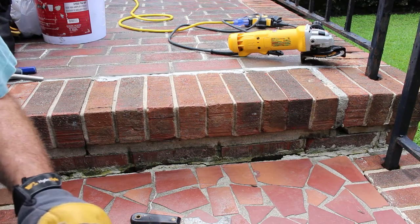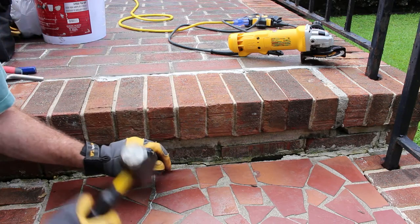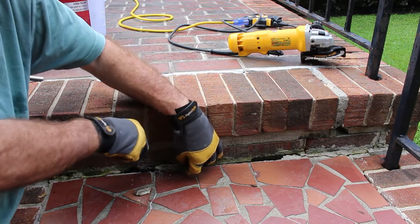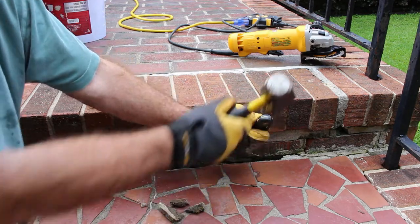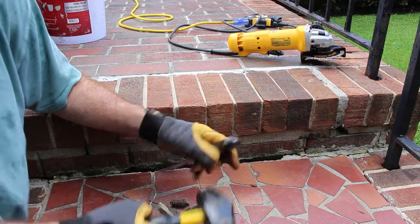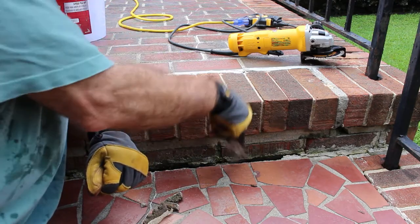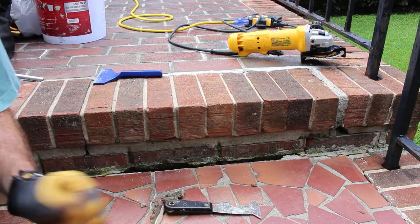The first thing I'm going to do is a little excavating — removing any loose material in here. I'm just going to take this and this stuff is breaking off real easy, hardly even tapping on it. I've got a mortar chisel and I'm barely tapping on it. This works a little better the way the shape is to pull material out. You can use a mason's chisel as well. I'm just getting in here and getting rid of the loose stuff right now.